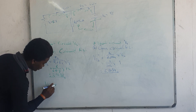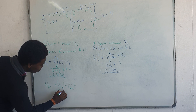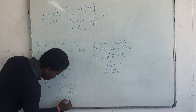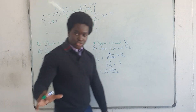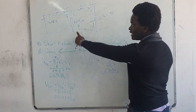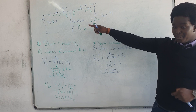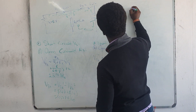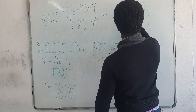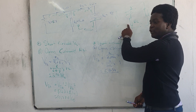We can say Vth total equals Vth1 plus Vth2, which equals 5.143 plus 5.143, giving 10.286 volts. This 10.286 volts is the total voltage being supplied by V1 and V2 at the load resistor RL. We can now redraw the circuit with 10.286 volts as the source, R1 and R2, and the load resistor.